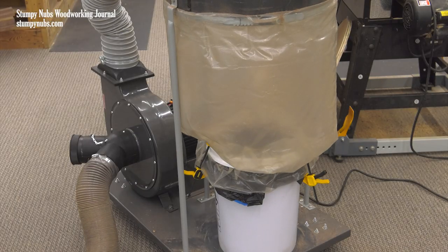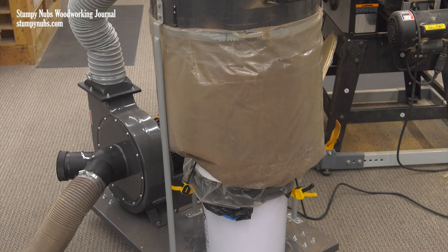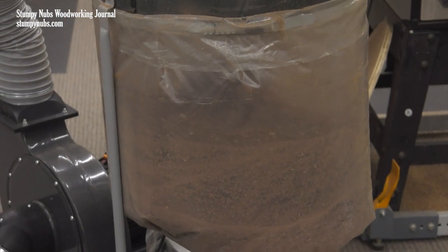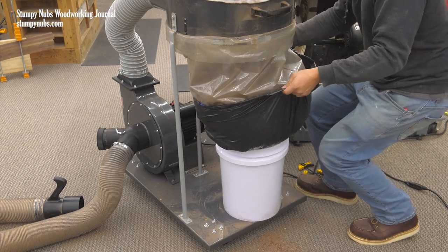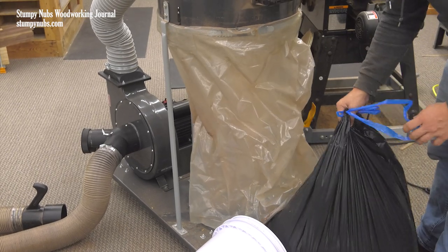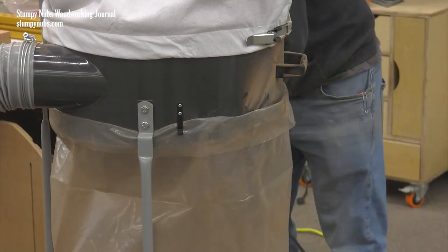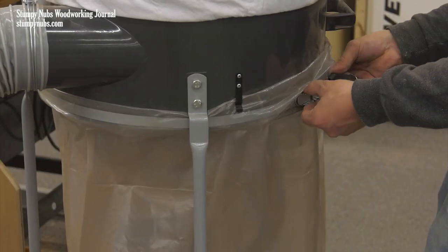As the chips come in, the heavy, clear plastic bag takes the abuse — it can handle it. The less expensive trash bag begins to fill up, and the 5-gallon pail will quickly overflow. That's okay — let the chips pile right up, about halfway into the clear bag. Now let's empty it. Release the clamps and lift the black trash bag up and over the outside of the clear one, creating a funnel that transfers all of the dust into the black trash bag with minimal leakage. Not only is this a lot easier than filling up your clear bag and then removing the belt and dumping it, but it also means you won't have to release that band clamp at all. Those band clamps are notorious for creating little holes in the clear bag over time, which then leak dust. This way, you leave the clamp alone and your clear bag will last for many years.